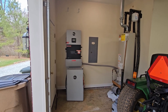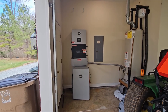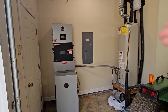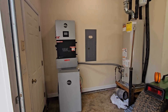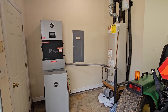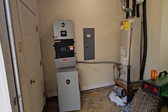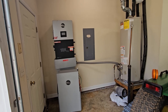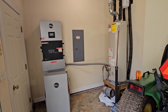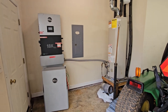This may be the last video. I have everything I need now to move this second battery over to the right-hand side of the distribution panel. I'm going to give myself the 15 inches of clearance I'm supposed to have and permanently install it there. I have the EMT conduit to run the battery cables, and I'm going to loop the solar panel DC through the distribution box on top of that battery.